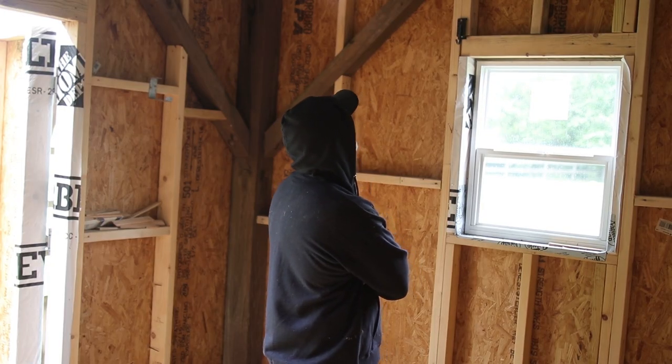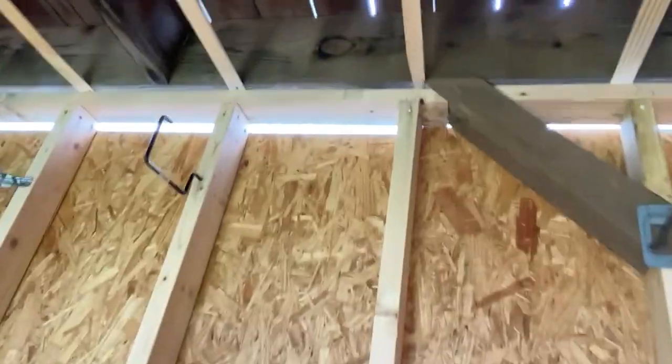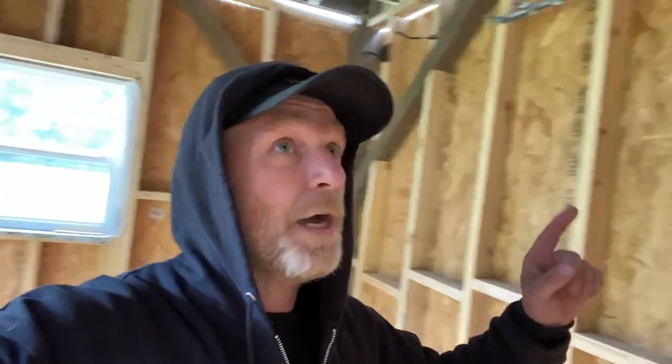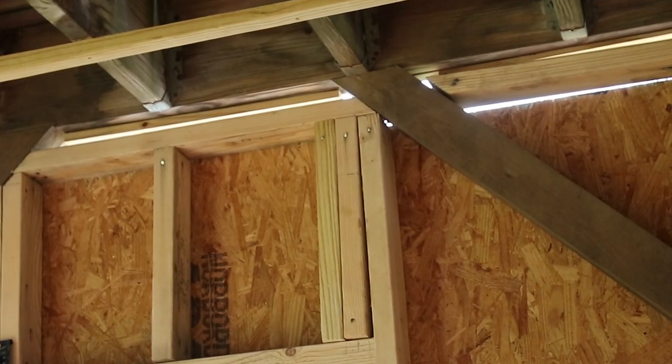Okay, so we got a bit of an issue. That's not going to be fun. When I framed this last year, I wasn't thinking about how we'd move it. I framed it the best that I knew. And these cross braces right here that run off of the posts — they are attached by these bolts. Not a big deal; I can back out most of them and we're good to go. However, in a couple of spots, I framed around those bolts. We're going to have to bust that with some power tools and cut around all that stuff.